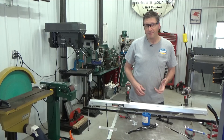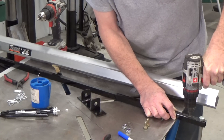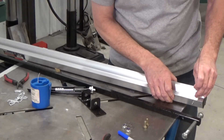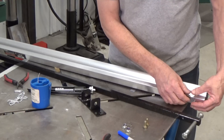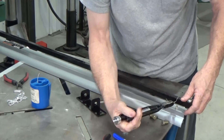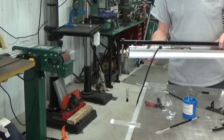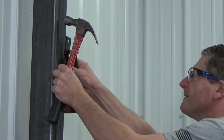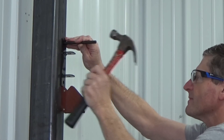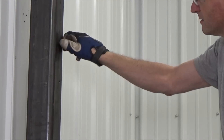At this point I painted it and figured out how I wanted to mount my light. Instead of using the chain that came with it, I drilled a three-thirty-second-inch hole through the square tubing where the chain would normally mount to the light, and I'm using 040 stainless safety wire running it through the light mount, up through the tubing, and then back around and securing the ends. Also make sure the chain pull switch is at the swivel end, not the outer end. For mounting to my steel post, I transfer-punched the wall mount holes, then drilled and tapped the holes for a three-eighths bolt. My steel posts are three-eighths thick, so this will be plenty strong enough.